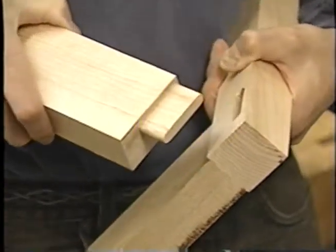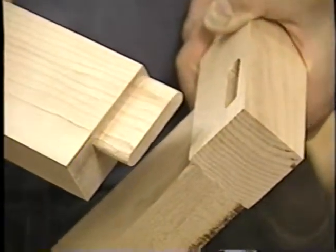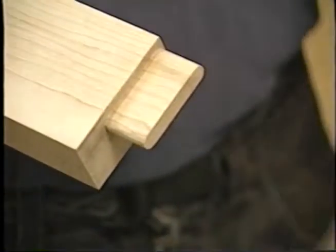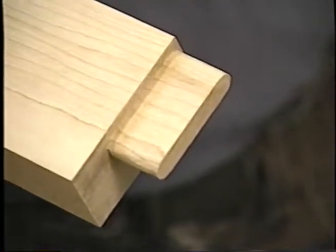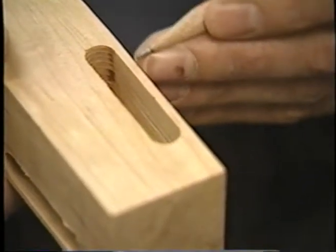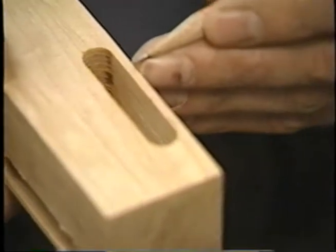The goal with mortise and tenon joints is to maximize the amount of good glue surface without weakening the parts that we're joining. Lengthening or widening the tenon is a good strategy for this, but when two seat rails meet at a leg post, their tenons will bump into each other while they're still pretty short, unless we move the rails and the joint to the outside of the leg. But you've got to watch the thickness of this little wall of wood between the mortise and the outside of the leg. This is too weak.